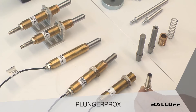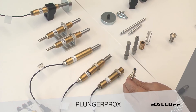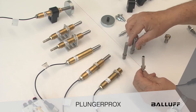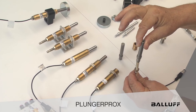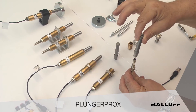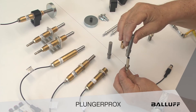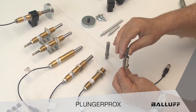There's a real advantage to it. They are off-the-shelf sensors, standard products. But when installed into this housing, when we depress the plunger it slides over the sensor, making the trigger point adjustable — the set point on this thing — and still provides over-travel so we don't damage any sensors.